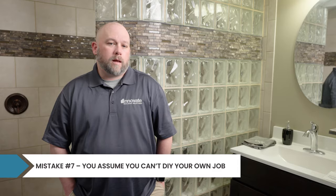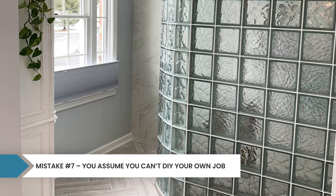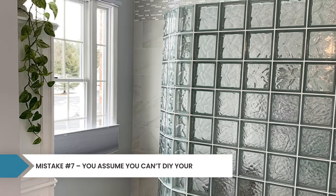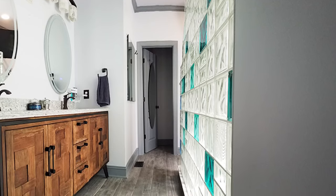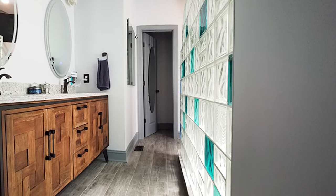There are pre-made glass block wall systems with a vinyl stack system where you can stack sections together — the curve is already built in, so you're basically following a template. Once it's all up and tack dry, you just field grout it. There's no way I would try to hand-lay a curved wall, but the prefab systems make it a lot easier in the field — you don't need a specialty company to install it; you could even DIY it if you wanted to.